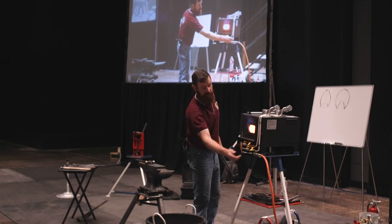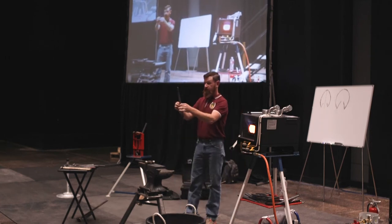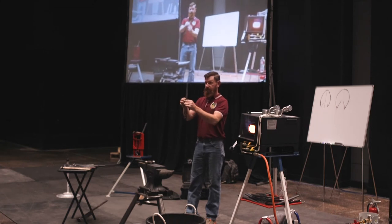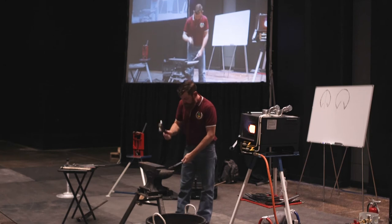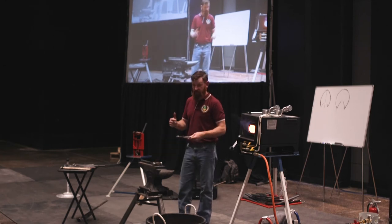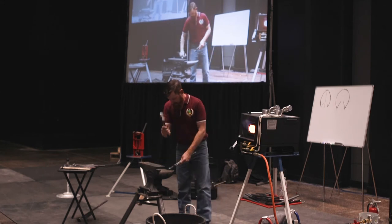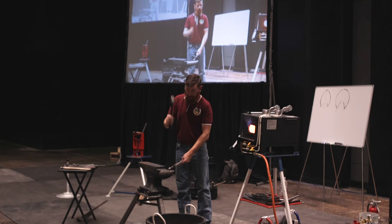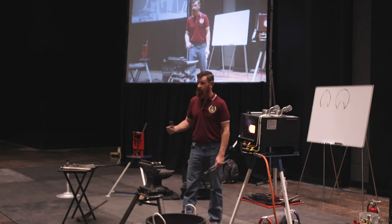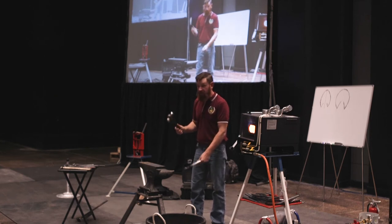At the same time, I'm looking and seeing how that section is moving. Is it going straight down or is it starting to twist? And that comes into play with your hammer. One shoe is going to be easier to do than the other, depending on which side the strong part of the section is, because our hammer wants to do this. So on one shoe it wants to put sole pressure in, and on the other shoe it wants to take it out, and then we can't get it back. So you have to be mindful of keeping that hammer pushing that section flat.